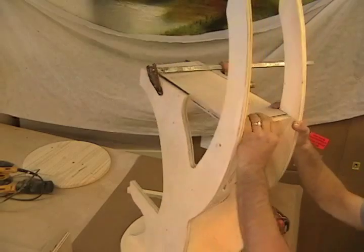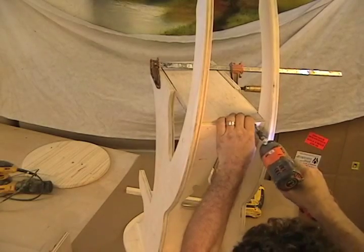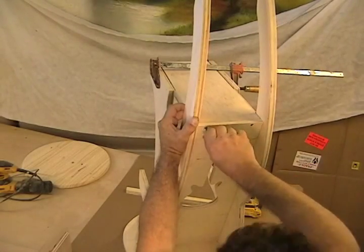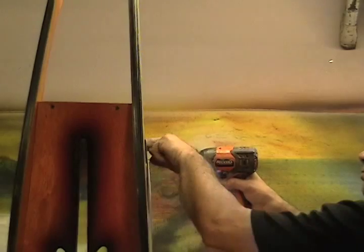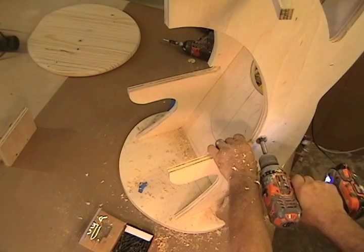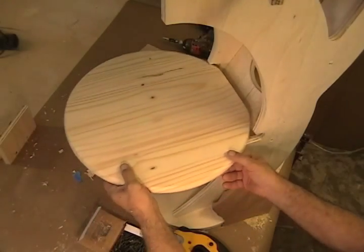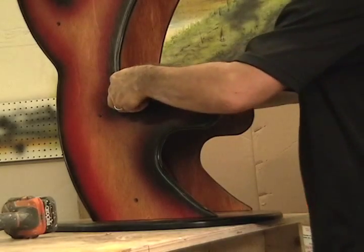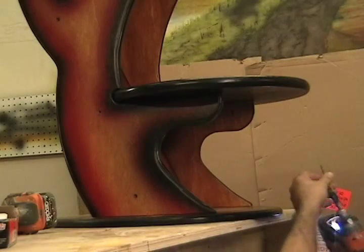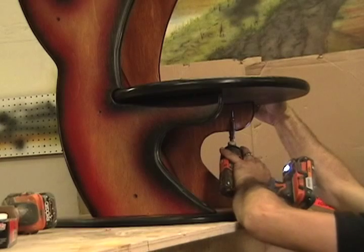This is our first peek of the frame in its upright position. We'll go ahead and put the screws into the seat support — also two-inch screws, pre-drilled. Next we have the cutout that will cantilever-brace the footrest to the all-in-one frame. Notice in this upcoming side view the major difference in Generation 3: the two protruding tiers support the footrest, allowing us to eliminate the original footrest support, making it look a little cooler and be a little lighter.